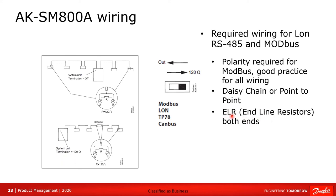You must have an end-of-line resistor (ELR) at both ends of your network. If your controller is at the end of the line — meaning a single cable comes in with no cable leaving — you can turn on the switch to engage a 120-ohm resistor. If the end node does not have a switch, you'll need to install a 120-ohm resistor manually.